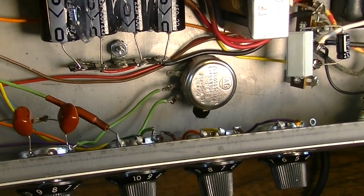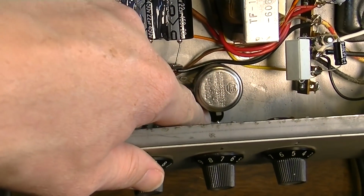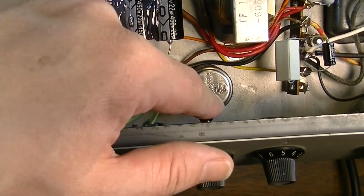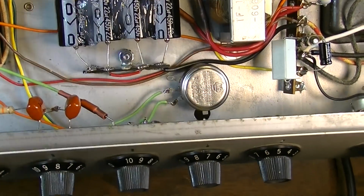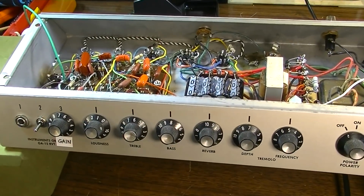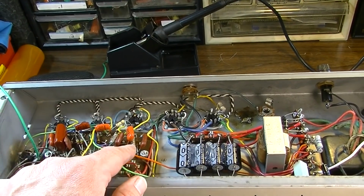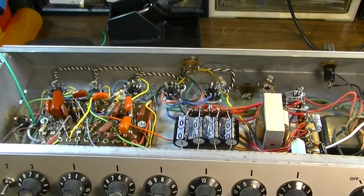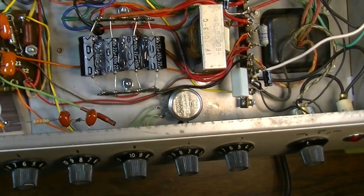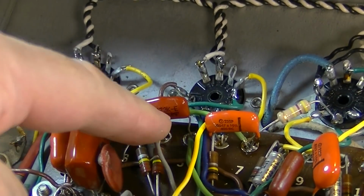If you reach back behind the amp, and you have to actually reach back behind it when it's all together. At first I drilled a hole here and wasn't thinking, because when you try to get it in the cab it won't go in, so I had to move it back a little further. So that's my fault. But that's a cool little hidden thing. There was really nowhere on the front panel of the chassis to put a mid-range control, and if I put it on the back, that would put it close to all the 6-volt windings, and you would have to run wires again, and I just didn't want to do all that. It was better off putting it here and making it a set it and forget it sort of control. But like I said, from this point here, it goes into two different directions.